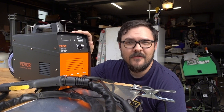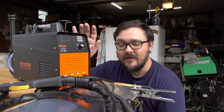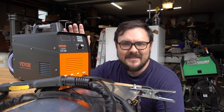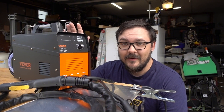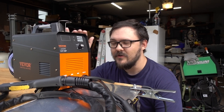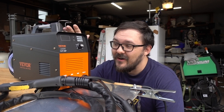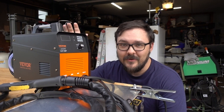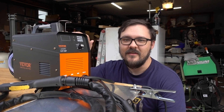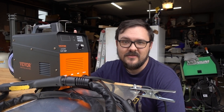Some of you may be asking: can you use this machine for a CNC plasma cutter? Technically yes, but you're going to have to commit a lot of time to shielding and grounding your whole machine to compensate for the high-frequency start. As I described in my CNC plasma cutter video, high frequency can interfere with the motors and control electronics of the CNC machine. It's not really recommended unless you already have a high-frequency plasma cutter and are willing to put in the work. The low-frequency start machine I ended up buying for my CNC has never had any problems, and that's why I went with it. For dedicated handheld use like this, the high-frequency start is not going to cause any issues.